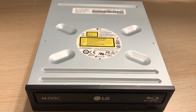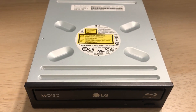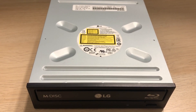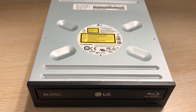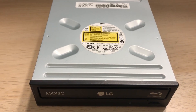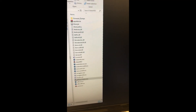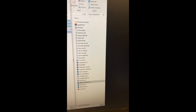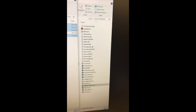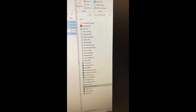My first step was to check the firmware. You may get a drive that you don't know anything about, and if it's not actually reading discs, I would definitely recommend finding out what firmware it's got and maybe flashing it back to the original firmware. I'm not going to explain the actual flashing process — that's probably best left to the online forums for MakeMKV. Here you can see I've got the flasher tool inside the MakeMKV folder — it's called SDFToolFlasher.exe.